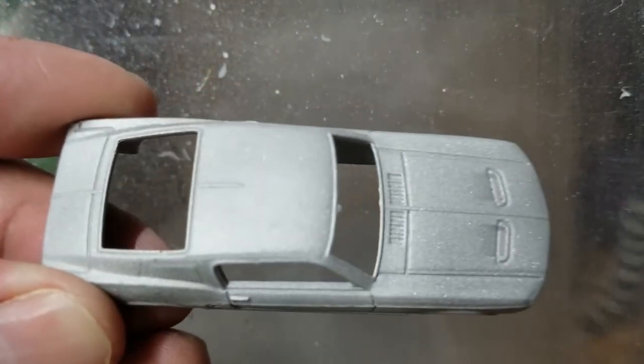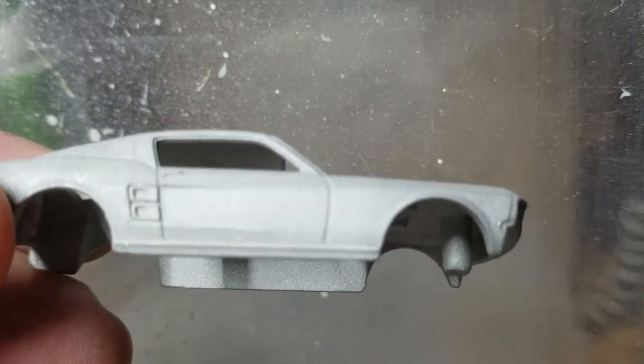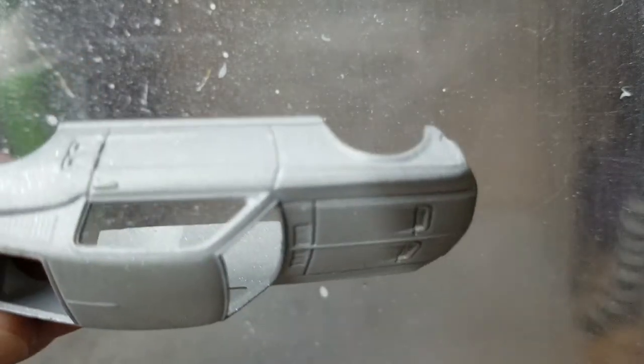So out of the sandblaster is our body. They've got the nice little sandblasting media haze on there, so we're going to buzz that off here real quick in our wire wheel booth, and just run this thing across all that, nice and light, nice and easy. That little haze will come right off. You'll get a pretty nice little shine under there, and you'll be able to see all the imperfections and whatnot if there are any. And that's what I do to get this thing fixed.